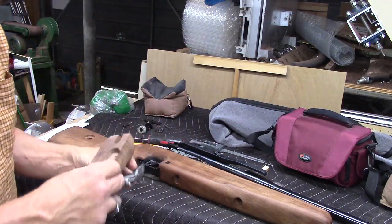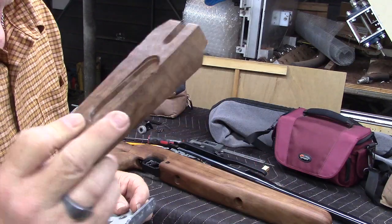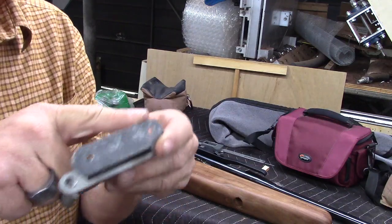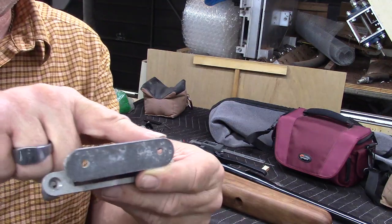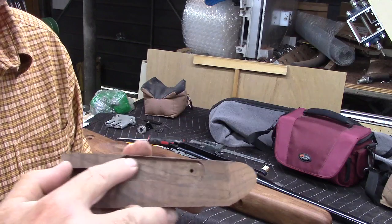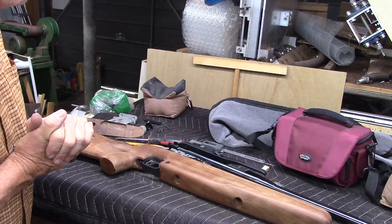The main issue is, isn't it curious how the mechanism sticks so far out to the side? What happened is the wood got paper thin there because of that. When we're finishing, we may sand through it. My idea is to sand down — or maybe mill down — this piece, which appears to be cast and probably not a great material. I'd take the height down a little bit and then glass bed it, filling this super thin piece of wood with a thick layer of glass-reinforced resin.